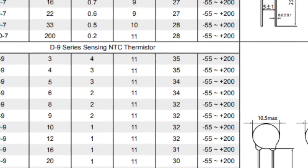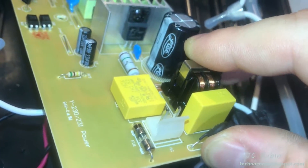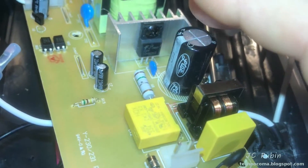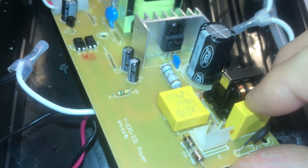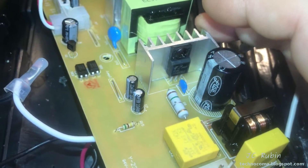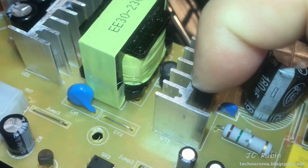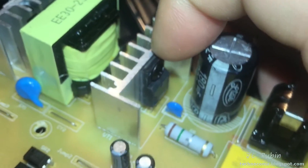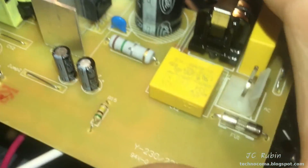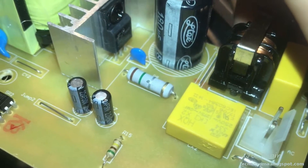The thermistor reads 5D9, so it's possible this thermistor is inadequate for what's going on here — I can't really say without the tools or the ability to fully break it down since it's under warranty. On the oscilloscope I'd bet one or more of these components is substandard. The heatsink may also be inadequate. Is the thermal connectivity between this component and the heatsink sufficient? It could have gotten too hot and failed. The paint is also coming off of this resistor — that's notable, though I can't be certain it's the cause.